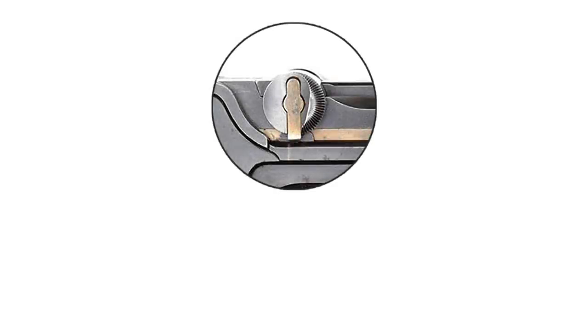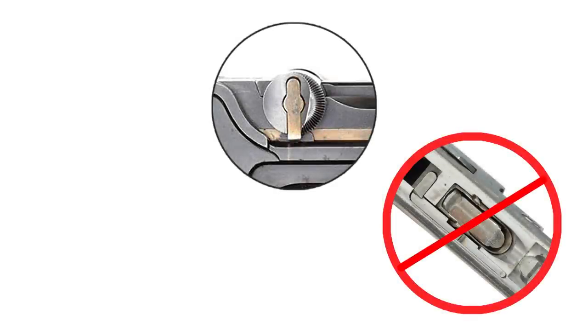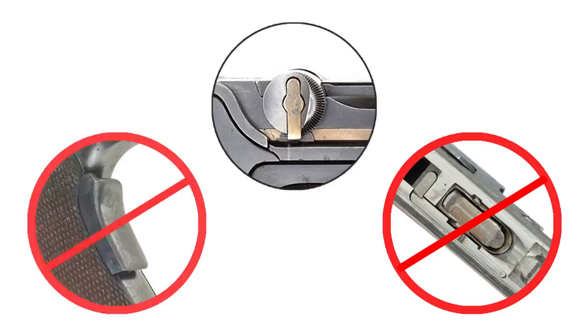By July of 1901, the Mannlicher was abandoned. The C96 was being tested for mounted troops with the stock, and the Borchardt Luger was receiving a favorable report. Really, the only major problem noted was its complexity compared to the C96, apparently 59 parts compared to the Mauser's 37. Over time, Luger would simplify the rebound latch, saving 4 parts. He ditched the hold open entirely, just for the GPK, mind you, saving 3 parts, and dropped the automatic safety, but did have to ultimately keep a manual one.